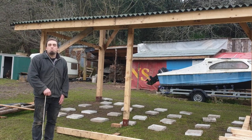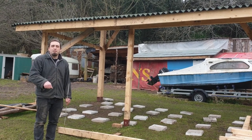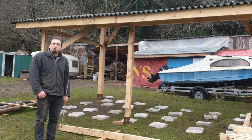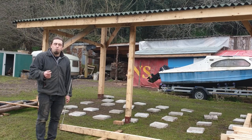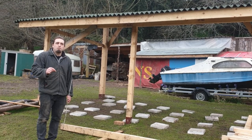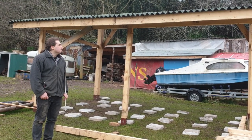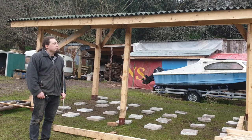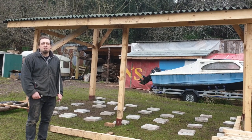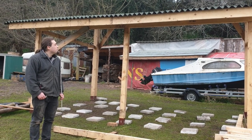I just made one mistake, as my grandad came up and started talking and distracted me, and I went in a little bit too far. So made quite a dent where the screw was. So I'd flooded the hole with roofing sealant, and then put some 1¼ inch rubber washers on top of that, and then put the screw in to try and fill it in. Hopefully that should stop it. Otherwise, I think I did it on the end of a sheet, and I have a 1/4 sheet left over, so I might be able to use that to patch that hole. Hopefully it should be done. Other than that, it went pretty smoothly.